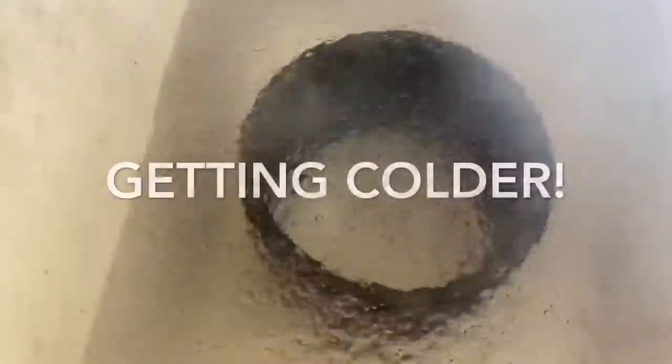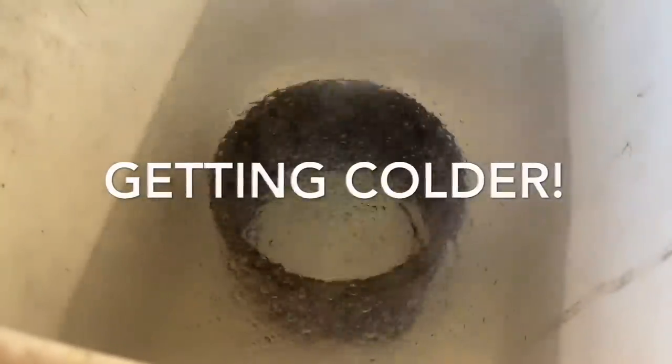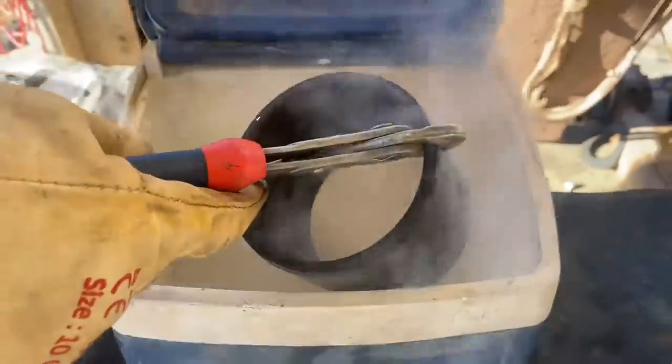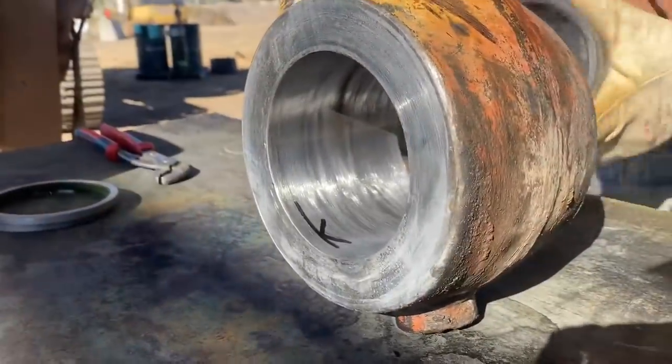As the bush freezes down, it boils less and less gas evaporates off — now you know the bush is getting close to its lowest temperature. When you think it's ready, remove the bush and go slide it in. It should just go in by hand.